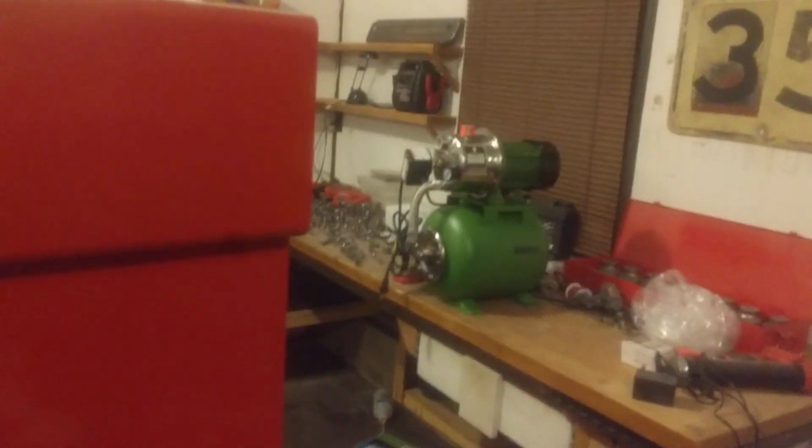I've got a 30 amp right there on the wall, and I'll probably use that for this guy. It's a 1 horsepower pump, so I probably don't need 30 amps for that, but since that's right there, that's what I'll use for that pump. I do have this box here that I could use, but probably what I'll end up doing is running a separate power line over here for the pump, and probably put in a GFCI right there for the sump pump, and then that one will probably have to go on the bottom, because I have this sub panel right here.